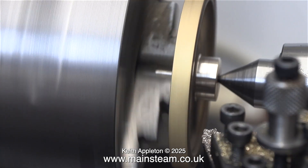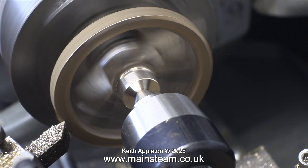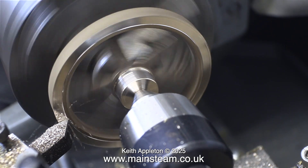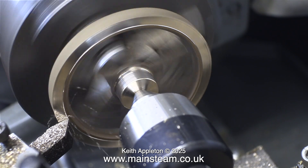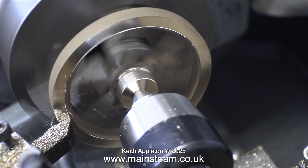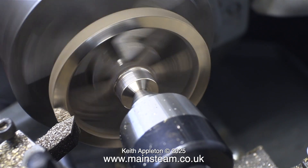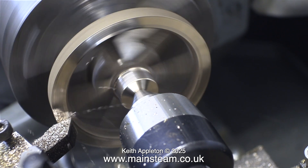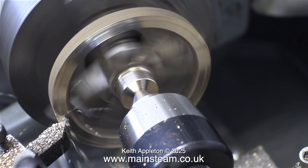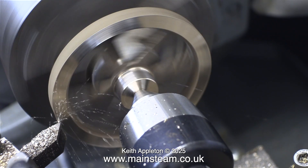Before turning the outer diameter of the flywheel I fit a live centre into the hole in the middle. These clips are running at a much higher speed than they should be really, just to get through the turning operation sequences. It's quite important to take fine cuts — gunmetal is a very soft metal and it distorts easily. I often move the lathe tool in the tool post, because the logic is that this part of the cutting tool is sharper as it's done less work, giving a better finish. But alas, not always.